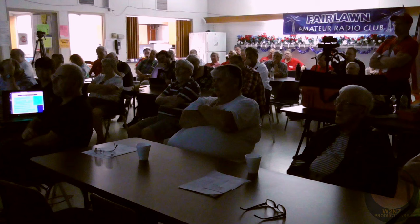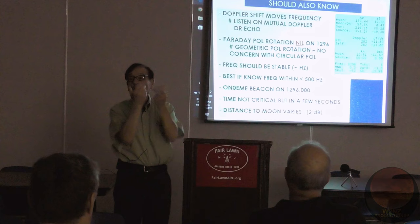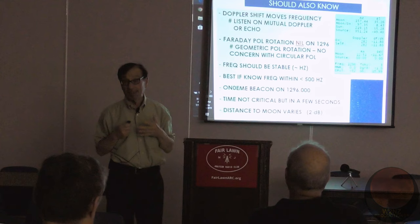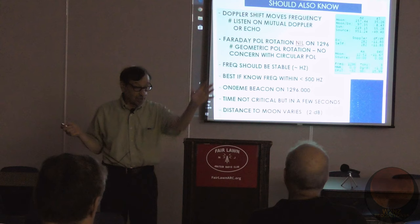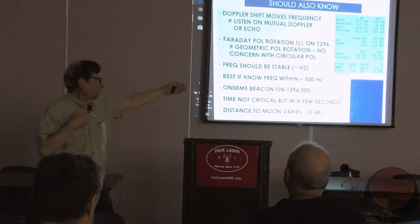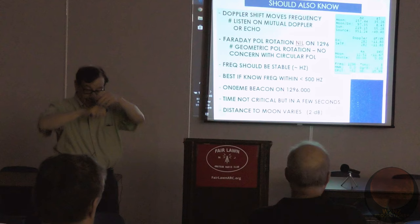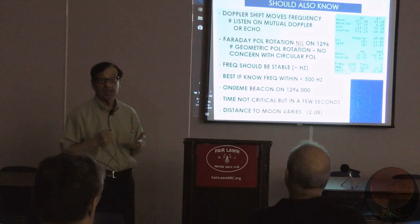But in the case of the moon, where everything is all over the place, you get a scattering of the signal off the moon. So you don't get really a coherent reflection like you get off a plate. Okay? So everything goes all over the place. And so you get less gain. That's part of the loss of the moon. It operates like a radar. A radar has the same problem: when it hits something, it's very unlikely that the surface is going to be at right angles to where you're hitting it. And if you got something over here, and you can see, if it was flat, you hit it, all the energy would go this way, and very little would come back to you, right? So you have the scattering problem. Things are not perfectly smooth, and it scatters back to you. That limits the amount of signal you get if you look at radar. And the same thing applies to the moon.